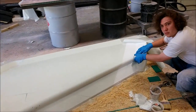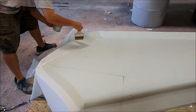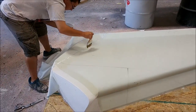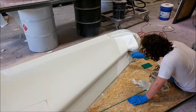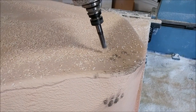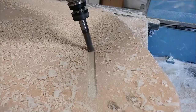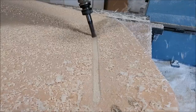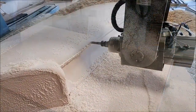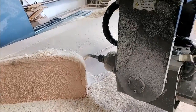Zack had gone and cleaned it up around the edges, and Devon and a second person are laying up the fiberglass on this one so it can be sprayed with putty — that makes all four strakes, upper and lower, left and right, pretty much in the process of being done in terms of creating the plugs. This is the right-hand side upper wing strake in putty, ready for its final milling, and this is just the first cut starting out on one of the flange areas. Jeff's got just the right amount of putty — no low spots and not too deep.